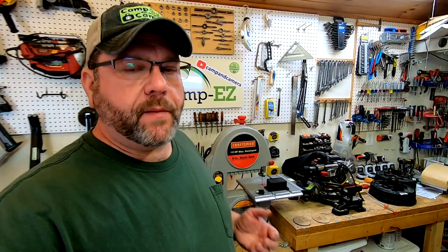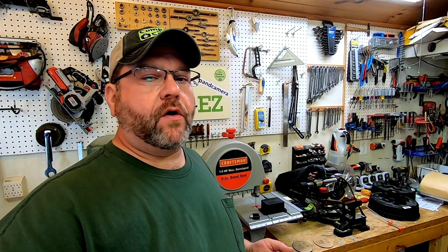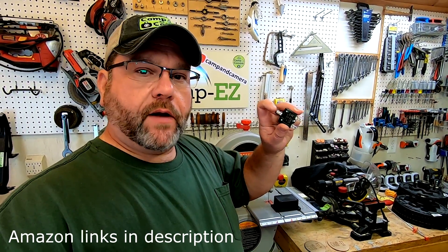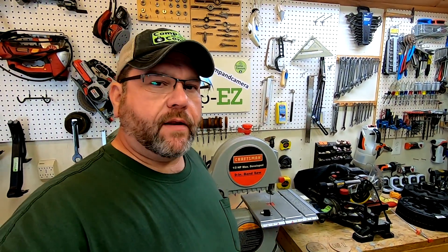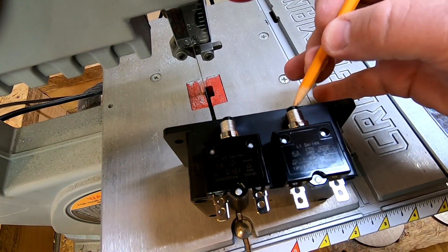The first thing I want to do is make up the breaker box that goes between the switch and the charge controller. The breaker box will have two 5-amp breakers capable of holding 50 volts — one on the positive and one on the negative. This is what the breaker looks like; it's just one of these little push-in breakers. I bought this little plastic box for about $3 and I'm going to make a breaker box out of it, with the breakers side by side coming out of the top. I'm just going to mark off where they're going to be.